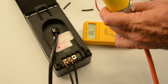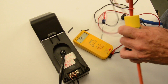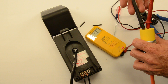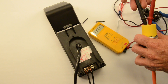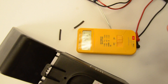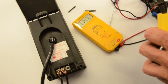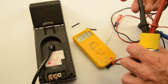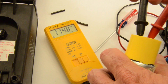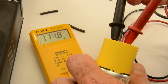We've got the extension cord, plugged the test transformer in, set up the voltage meter with probes inserted. Today's voltage at this particular time of day — with the air conditioners running in this building — is 114.7 volts. Your voltage will change throughout the day; the more load on the system, the lower the voltage goes. In the middle of the night with no washing machines, air conditioners, or kitchen ovens running, you might find your voltage is 120 volts. Voltage into a transformer will definitely affect voltage out.